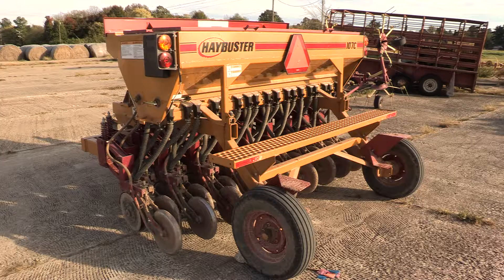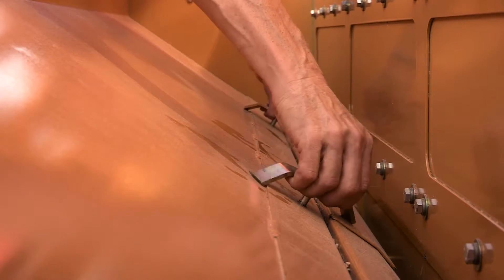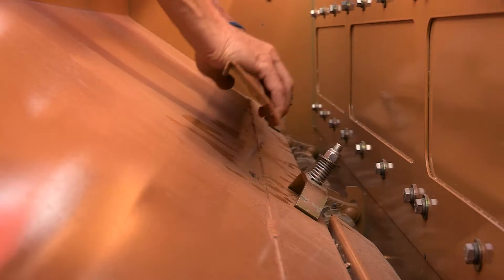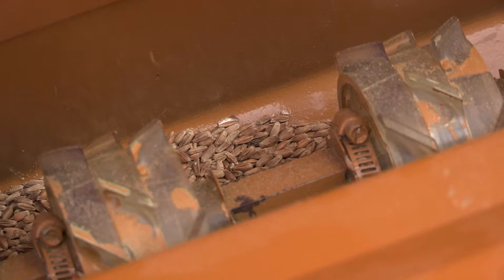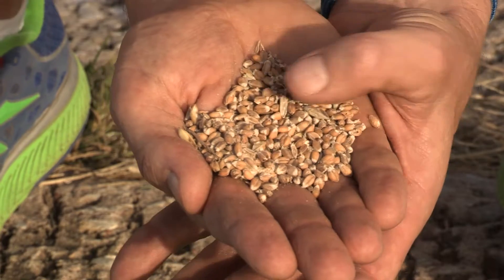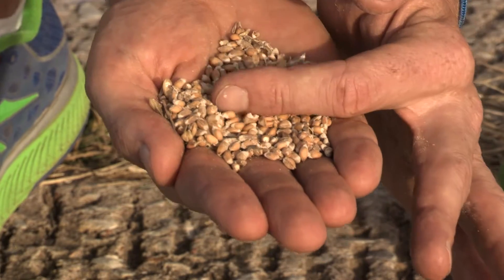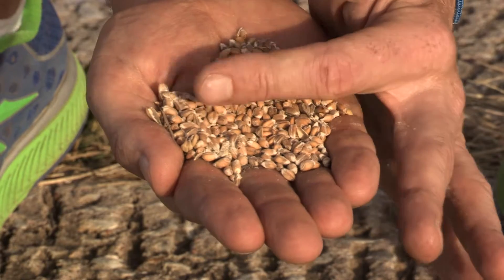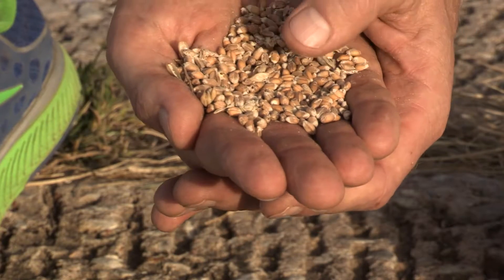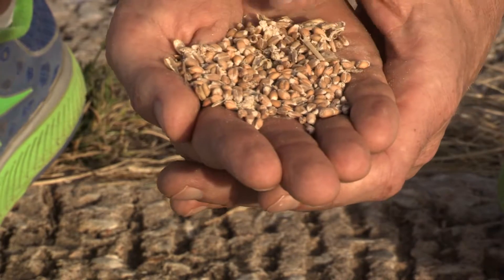In the back of the drill are boxes installed for larger seeds. These are constructed somewhat differently. The way it's constructed, you have to remove those pieces of metal to get underneath and clean that out thoroughly, because all down there is old seed from planting. All old seeds should be removed from the seed boxes to keep the drill in good working order for the next planting season, regardless of whether the seed is coated or non-coated. It makes it very unpleasant to work with if you just let it sit in there for months. You should clean out the seed boxes with a shop vac or with an air pressure hose by opening up the seed boxes at the bottom and letting the seeds drop out.